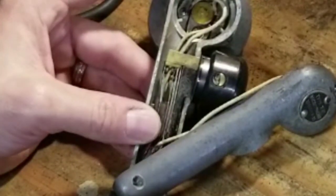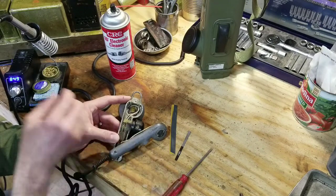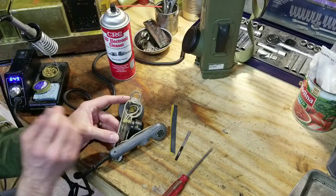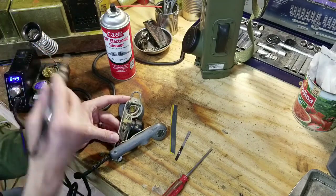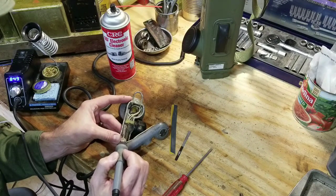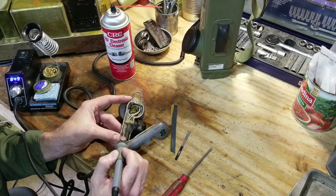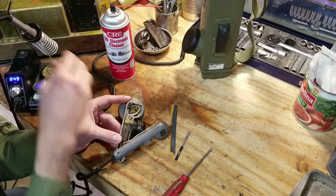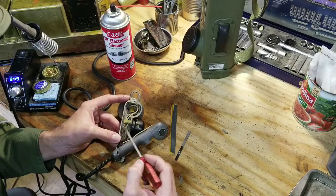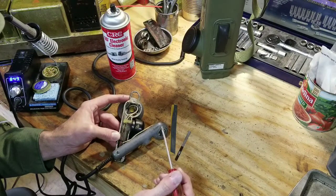My theory was that maybe I just needed to restore that electrical connection. I tried with a very hot soldering iron — I turned my soldering iron up to 850 degrees. I put a little bit of flux on there and I just cooked the connection between the back of the contact and the metal, until I had overcome the thermal capacity and felt like I had made a good wet solder.